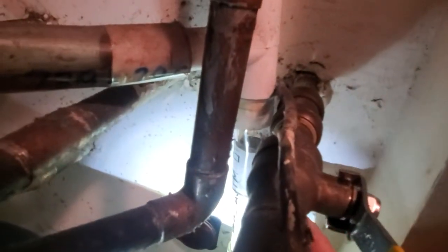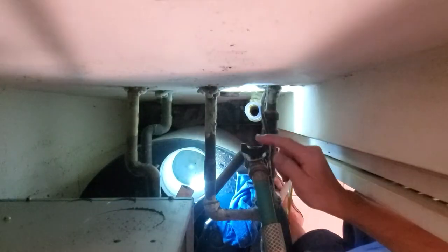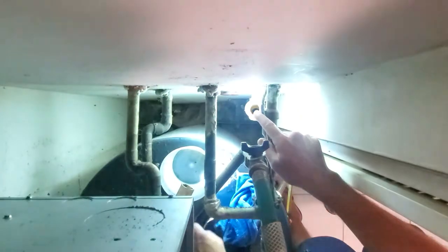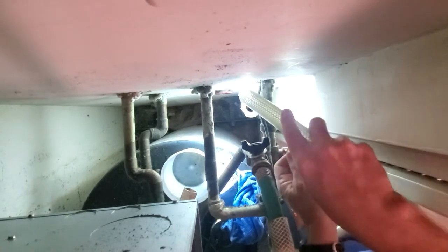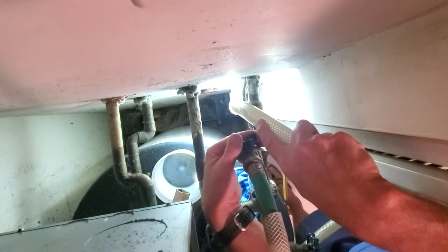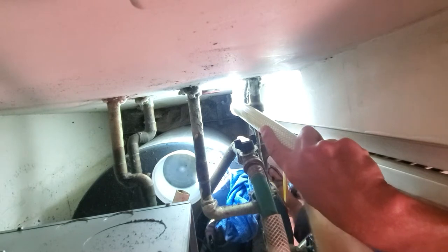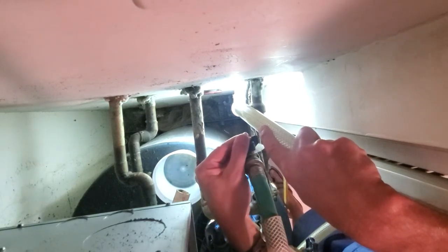First I need to drain it and then I'm going to clean all those pipes. This is my hose outlet and this is my drain, so what I'm going to do is put my hose inside of this tube and slowly open the water. I'm going to push the water out through the system, forcing and pushing all the algae that may accumulate inside of the drain outside. You can put more pressure or less pressure, however you want to do it.